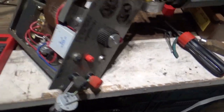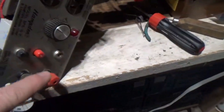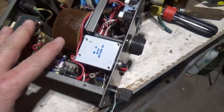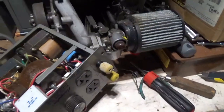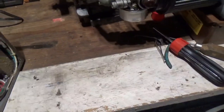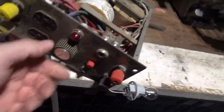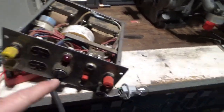This is the transformer that feeds the diodes that eventually comes out here. I checked and I have no low voltage — I don't have the AC, I don't have the DC — which is strange. I went back to the other side and I do have high voltage going into this. Kind of interesting that they put the rheostat on the front end, which means you vary the AC voltage going into the transformer that steps it down and eventually gives you the variable AC and DC output.